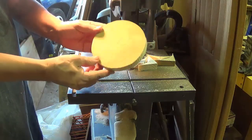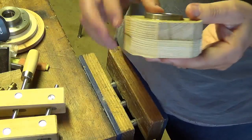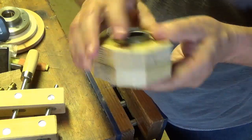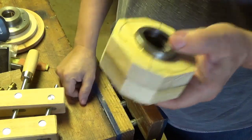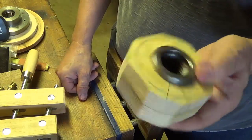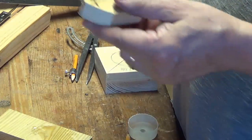There's my circle. Here's my first one and that didn't work out — it split. This insert seems to be just a little bit over one and three quarters inches. So what I think I'll do is go ahead and make another block and bore it smaller — instead of one and three quarters, I'll bore it at one and five eighths — then mount it on the lathe and enlarge the hole just slightly over one and three quarters. I went ahead and dislodged the insert from the wood; that didn't work out very good. It totally broke apart.